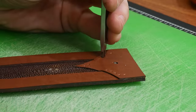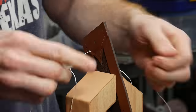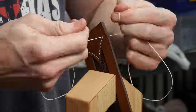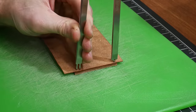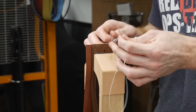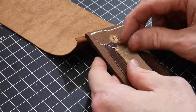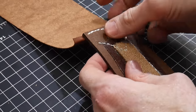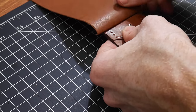It was around this time that I was really wishing for a sewing machine. Hand saddle stitching the chevron and stitch-down liner on the front pieces of the sheath didn't feel ideal, but it got the job done. The front pieces with the window cut into them are a little thick, which causes the chevron to have a hump and the inlay to sit deeper than I'd like. In the future, I'll split those front pieces and may leave the chevron a little thicker. I also purchased a stainless stud from Tandy and used some JB Weld on the threads to make sure it never moves.